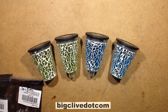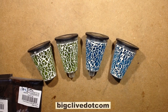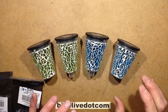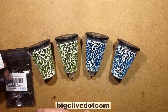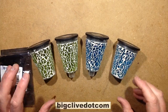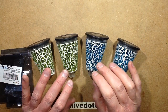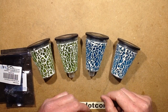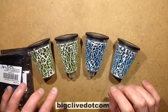They've also got ones with yellow and red glass as well. I thought it'd be quite interesting to get the blue and green ones, which are fitted with cold white LEDs, and swap in actual blue LEDs and green LEDs to see if it makes them look much brighter. At the moment with the white light it's using subtractive filtering — it just blocks the wavelengths that aren't needed — so theoretically it should be more efficient. But is it actually going to look that way?